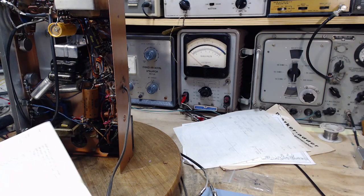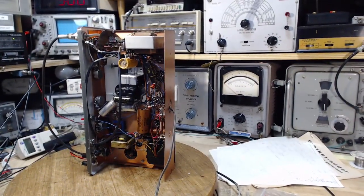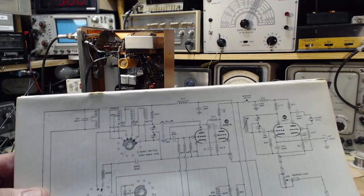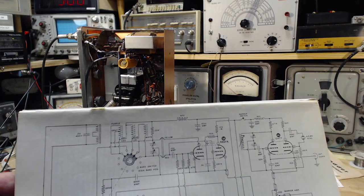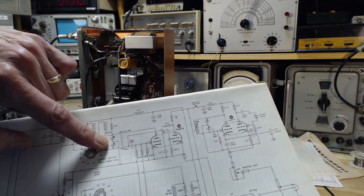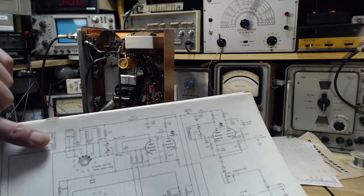This is the key component that sets this device apart from other sweep generators. The sweep range on this is huge, 60 megahertz or something like that. I explained before how difficult it is to make this happen, and they're using a special transformer, an Increductor, incremental inductor, Increductor. Here it is, it's all this. These coils are forming the resonant coils against these capacitors here to generate an oscillation amplified by this amplifier. That's how it's working. This coil is of great interest.